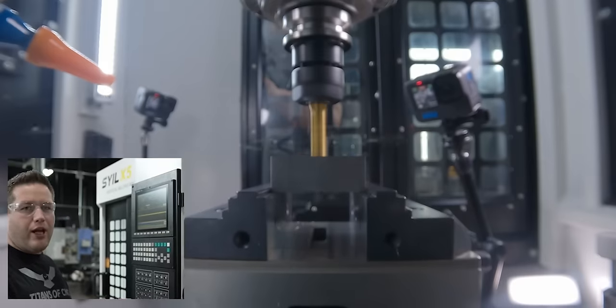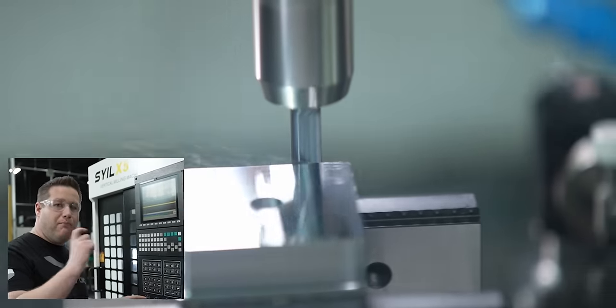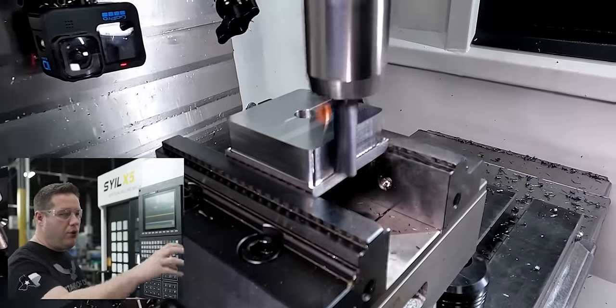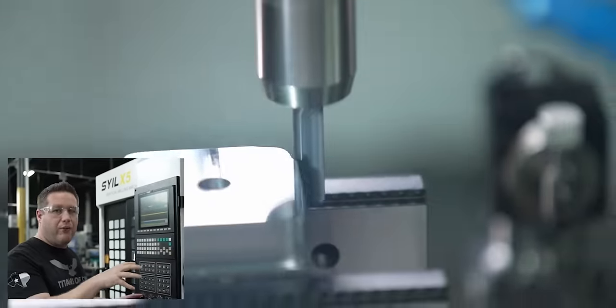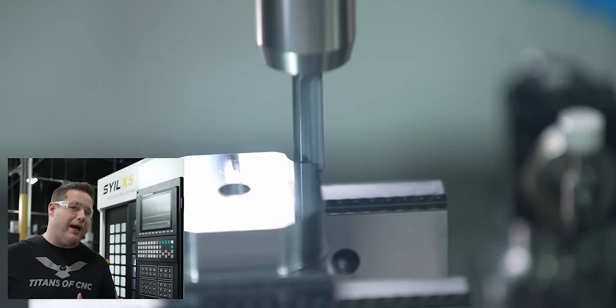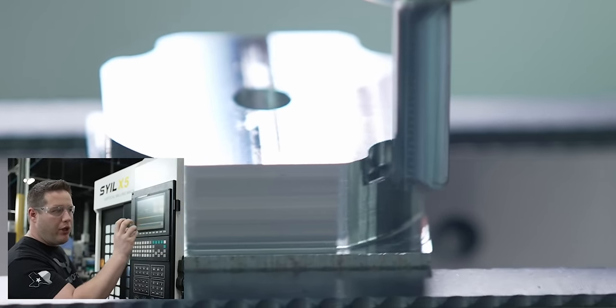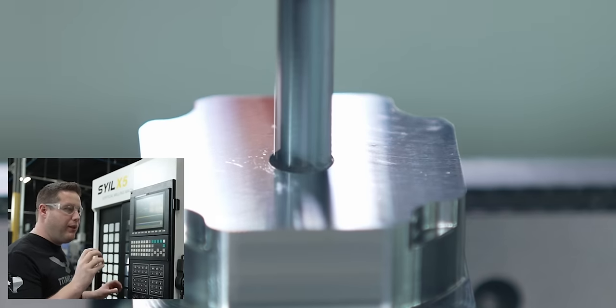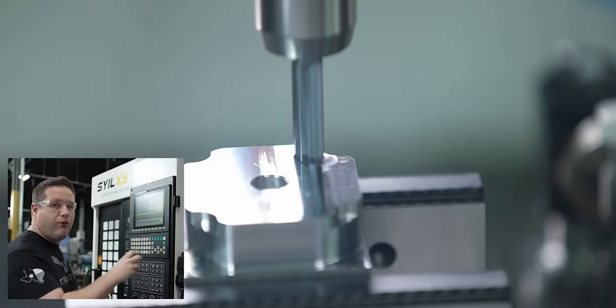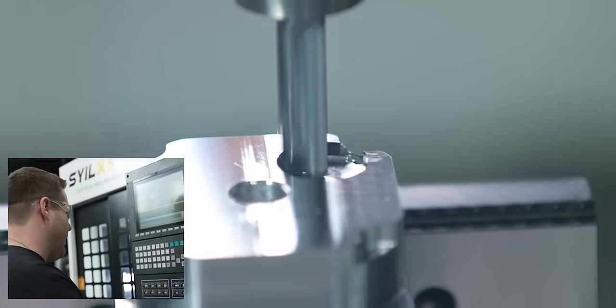The part that we're making now is one that I didn't show you on the computer. This one is going to be the mount that's going to allow us to move our tool setter wherever we want inside our machine. Since these tool setters are wired, we can't actually take them out. So what I'm making now is a little mount to go on the side of the machine to be able to put that tool setter wherever we want.